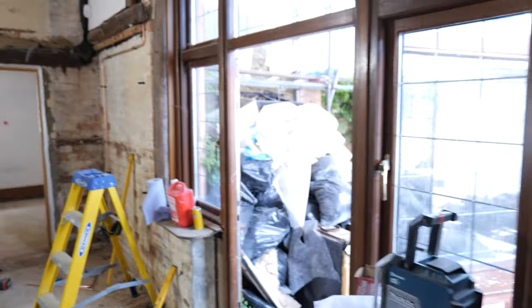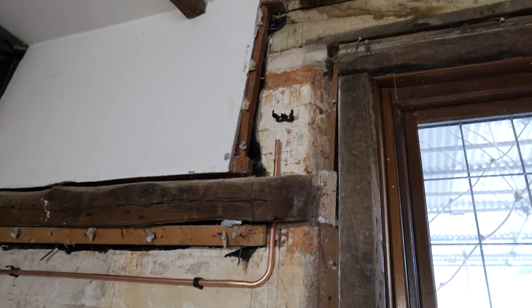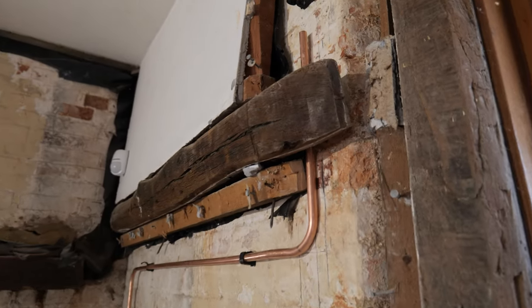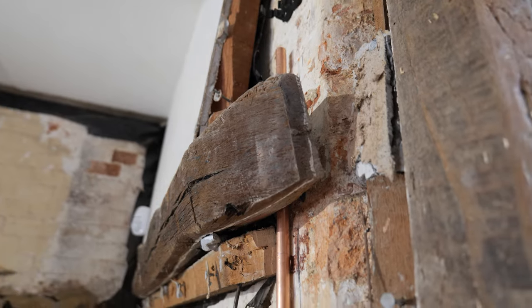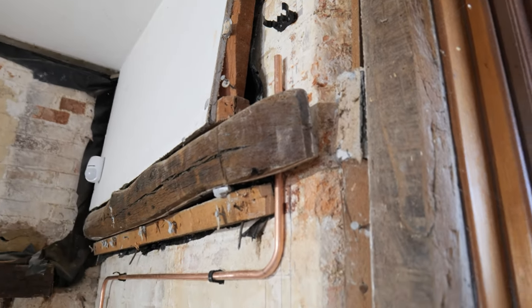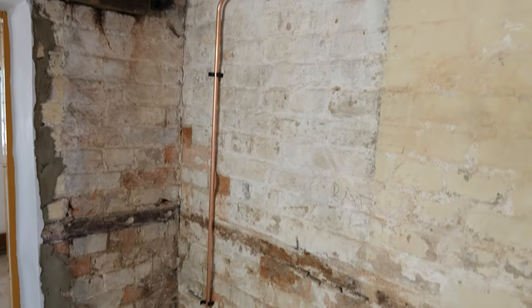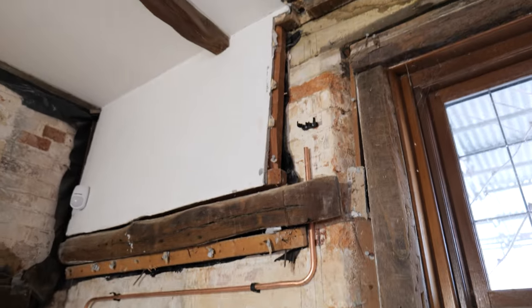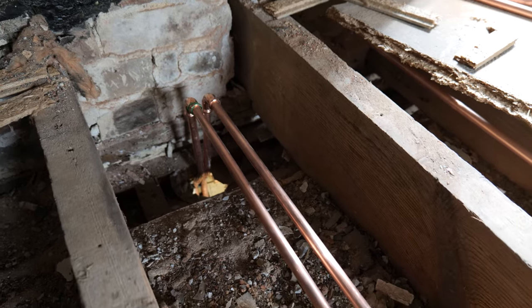My father went straight to the easy side — Bailey's got the more tricky one; he's got to come behind that beam. There are a lot of sections like this where we don't want to damage the timber that's going to stay — it's been in there for hundreds of years. We're trying to get the pipe behind it as much as we possibly can. He's doing the same thing, just dropping down to the TRV level, so I can jump upstairs and get those teed into the manifold.